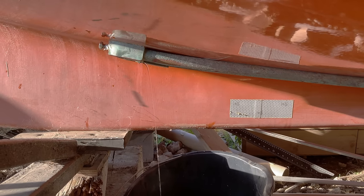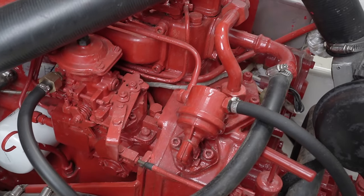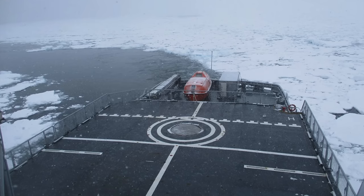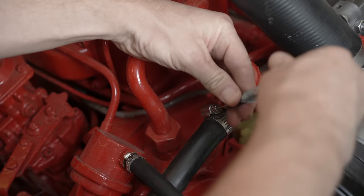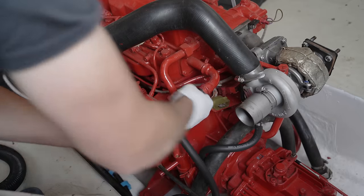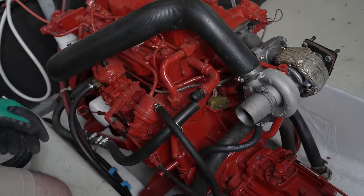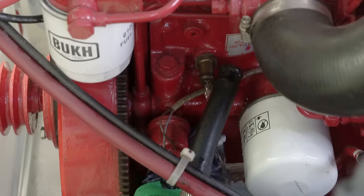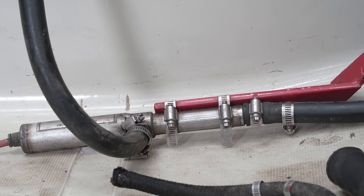I could start the disassembly in the engine bay. I thought I'd start on the easier port side. This is a simple bypass with a preheater mounted on an arm. This is so, if the engine is started with a lifeboat suspended on davits out of the water in a cold winter, and the coolant fluid well below 0 degrees centigrade, it doesn't zoom into the engine and upset it. We don't need this, as Alan will always start up when in the water, which is of course warmer than cold winter air. The assembly is bulky and in the way too. Plus, the heater is 42V AC, and we don't do 42V AC on board Alan. The hoses start to come off, and the first does not bode well — really well stuck on — and I decided to go for the famed slice, cut and chisel technique to get it off. The other end was a little easier, but I had a sixth sense we'd meet a pocket of trapped coolant fluid, and we did. The rest of the clips and bolts weren't too much of a calamity, and the arm came off. I cleaned the heater up and stuck it on eBay.